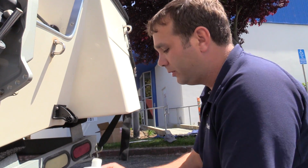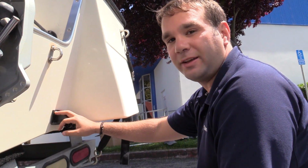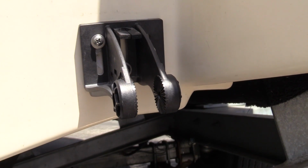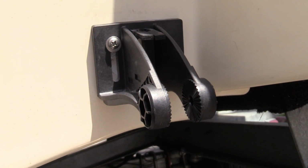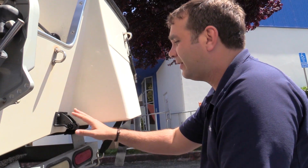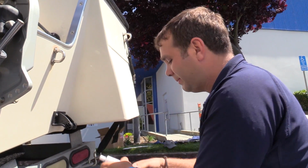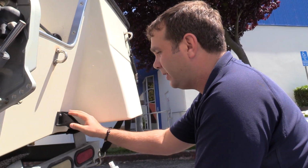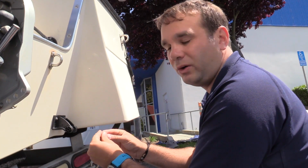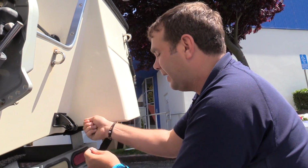2, we lubed up the fasteners with some wax so that we could reduce the friction as we were tightening in the fasteners. 3, we used a hand screwdriver instead of using the drill. This fiberglass was very thick and really hard to go through. Once we got the fasteners to where we thought we could do the final job, we took some of the 3M sealant, put it in the holes, put it around the holes. The goal is that the sealant will coat the whole bolt all the way up until the nut is all the way through, and hand tighten everything in.